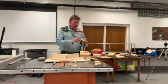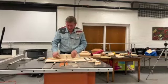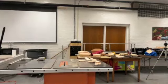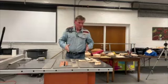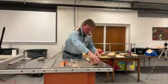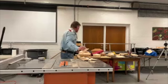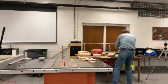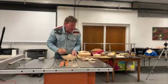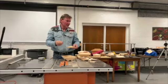Once we have these, we don't take this angle the same way we took the bottom. So let's say we have those four pieces cut. Again, the jig holds everything for you. Once you have that spacer cut, you just cut four angles on one side with the spacer, move the spacer over, cut your other four cuts, and you end up with these four pieces. And you're just matching the length of the... Yeah, all I do is I trace directly from the box. Once I have one angle cut, I just hold it to the edge of the box and make myself a cut, hold it there, put my stop block in place. So let's say no measuring, everything is direct transfer.